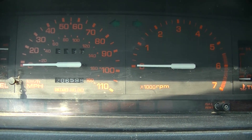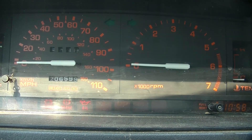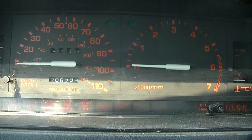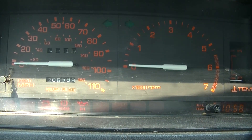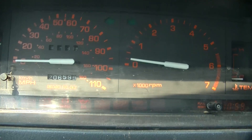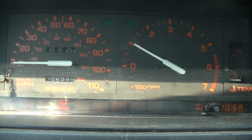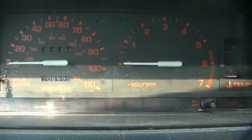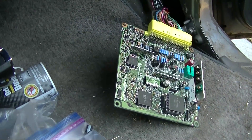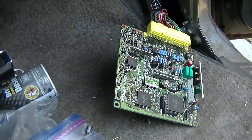What I've found works pretty reliably is to treat the thing like a diesel: just turn the key on and wait about 20 or 30 seconds, and it seems to start fine and run good all day. I'm watching the timer in the camera — give it another 10 seconds. Yeah it's a pain, but with the corrections we made, and going back over it again without finding anything else bad or eaten up, I no longer get the erratic idle speeds and check engine light while driving.